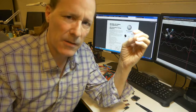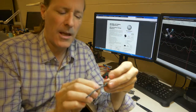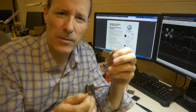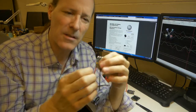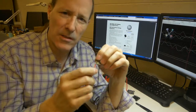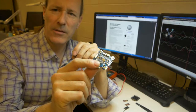But I was trying to think about whether or not I should film this, but it turns out that something cooler happened. So I was trying to troubleshoot this. What sort of troubleshooting is there for a missing pad? I'm trying to figure out where to solder onto this thing so that I can just fix it. It's a signal wire, just a low voltage signal wire coming from something like a flight control board.